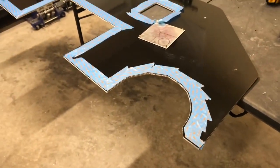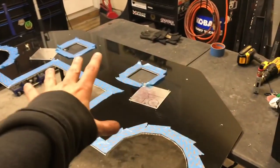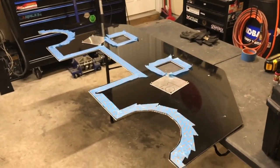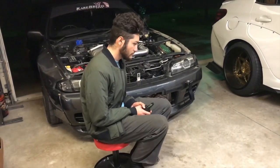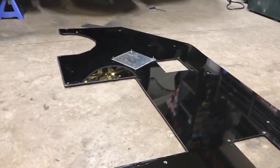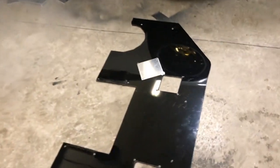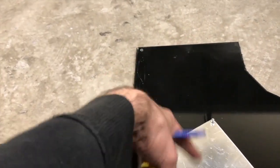I'm being a little over the top but I've got everything masked up so I can go ahead and seal around the back — make sure there's no open core. I don't want water or anything growing in there. I've got a mask on both sides, seal all the way around the edge. Should be pretty much tacked up and done. I did that on all the back edges. Now I have heat tape.